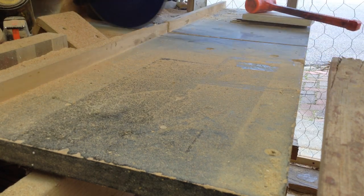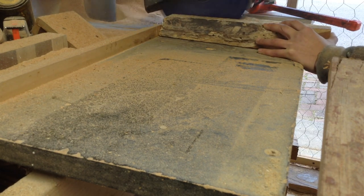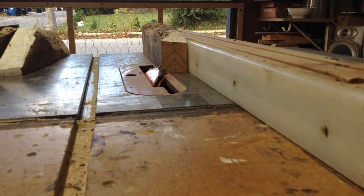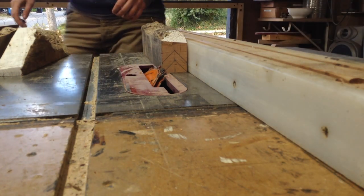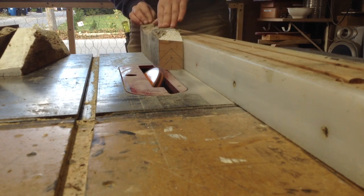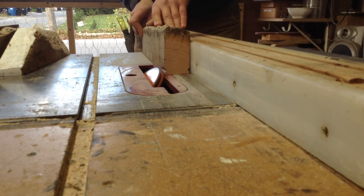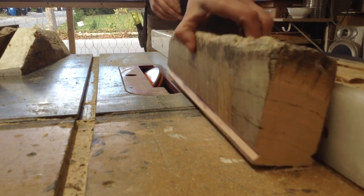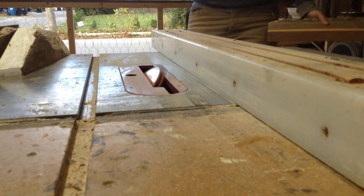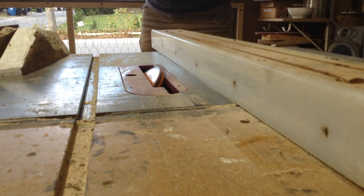I wanted the entire box to have a texture. One of the important aspects of these boxes is to engage as many senses as possible, so touch is engaged through texture on this box. I decided to do a lot of detail carving on the outside, which is why these pieces are so thick. Right now I'm going through and adding a dado on an angle so the pieces are angled off the box with a lot of surface area to carve.